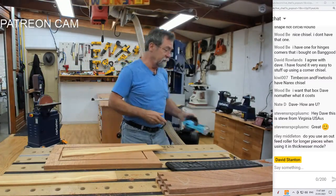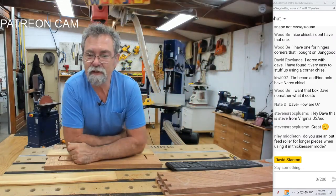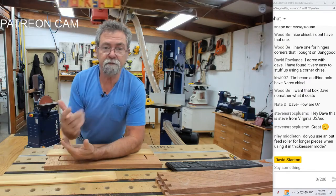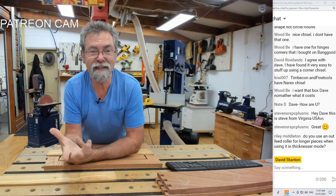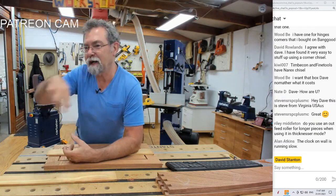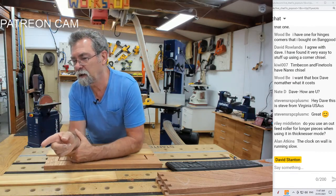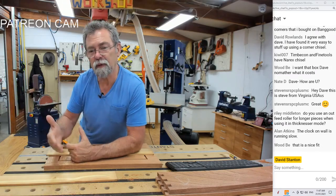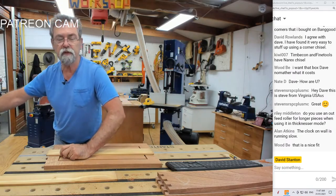Whoa, sorry, Zoe. We had a collision. Do you use an outfeed roller for longer pieces when using the thicknesser? Yeah, the outfeed table is basically my hands, because I normally feed in from one side until it's at the halfway point. Then I come around to the other side and tail it out. If it's a long piece, I'll bring it back away so it doesn't run into the table here.